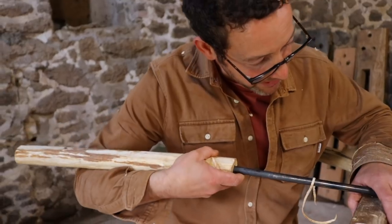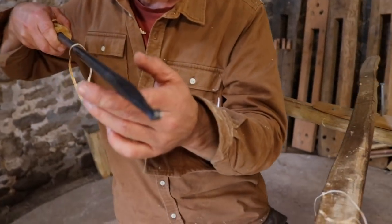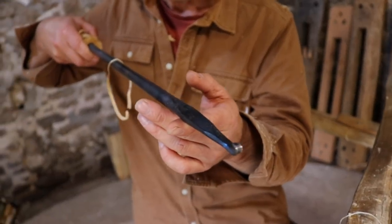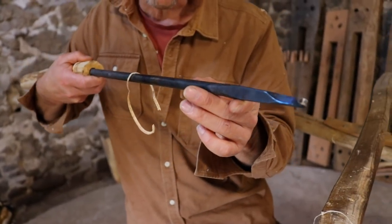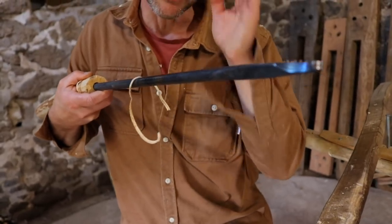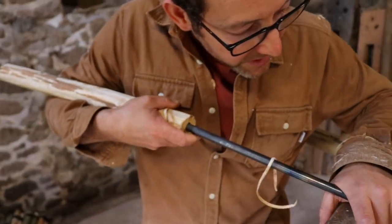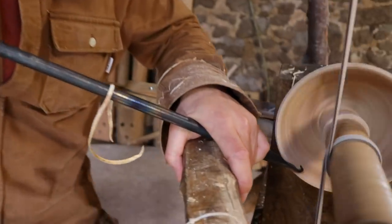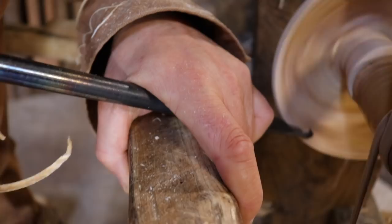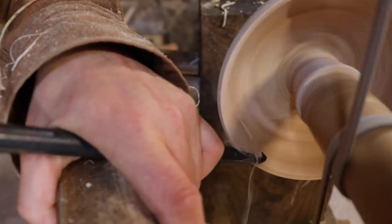When I get to the very centre of the bowl, it's twisted all the way around. And what's happening with the cutting edge is it's going from this position and it ends up near the core, almost pointing vertically against the surface of the bowl as it points towards the core. So, I don't know if you can catch that on the camera, but here, this is rubbing on the back, leaning in a little bit just to get it to bite.